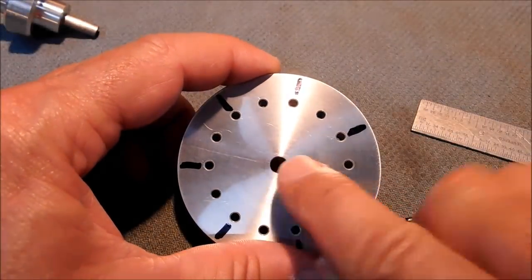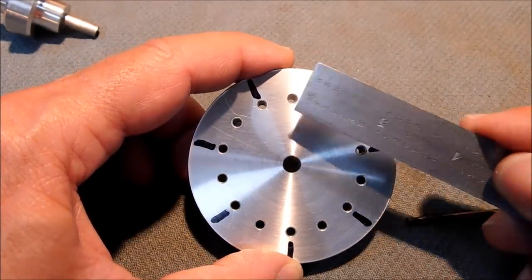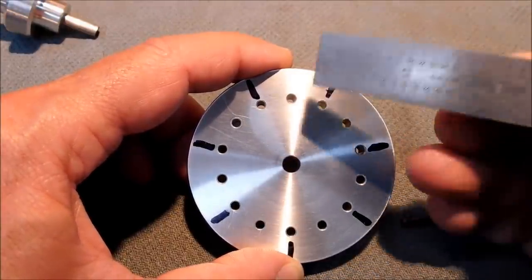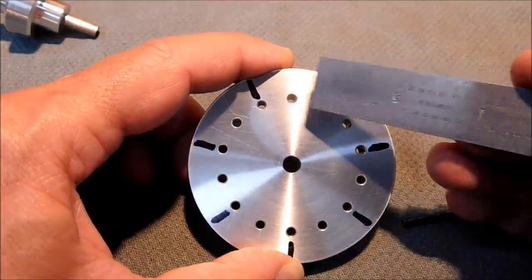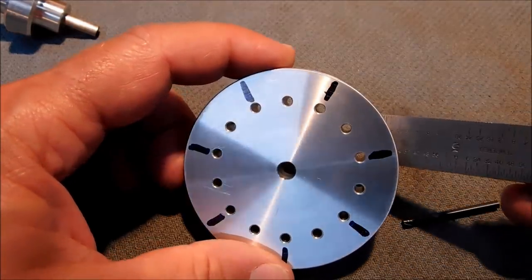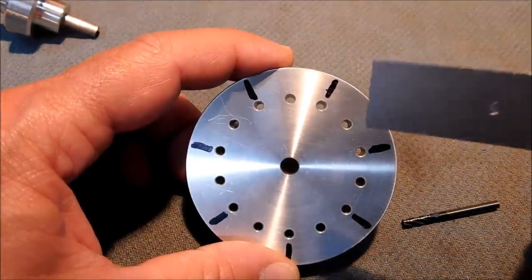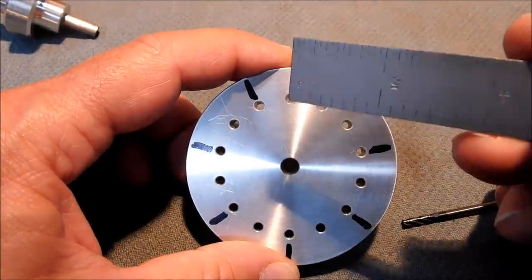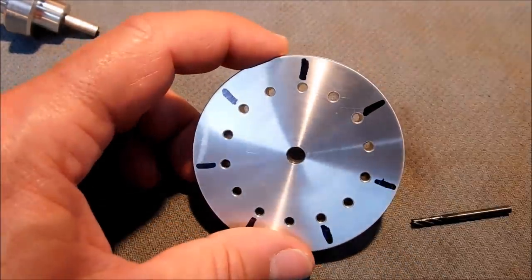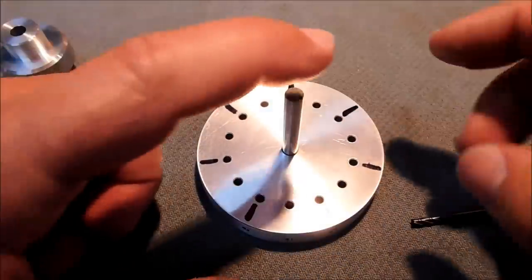about matching two holes exactly the same, especially if you triangulated these or rectangle drilled these and didn't do it on a rotary table. The distance between centers could be off by a half a thou or a thou, whatever, depending on what kind of math, readout, dial, equipment that you have. The center to center could be off. That being said, you do not need two perfect holes in order to index something precision. You just don't. You have one hole that's going to control location.